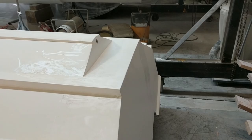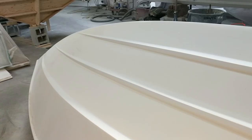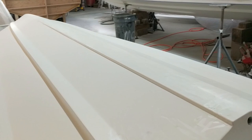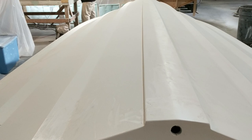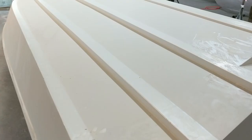Once that was applied and everything was finished off, we prepped the hull for the Allgrip 545 epoxy primer. You'll see there's tons of dust on it — the hull did sit after we sprayed it. I haven't totally decided on the paint color. We might just go with a white hull and then start the color above the waterline, but we're not sure yet. I'd like to go all one color, but we'll see. It's looking really good — very straight, it's been blueprinted, and it's much better than even brand new. We're really optimistic about that.